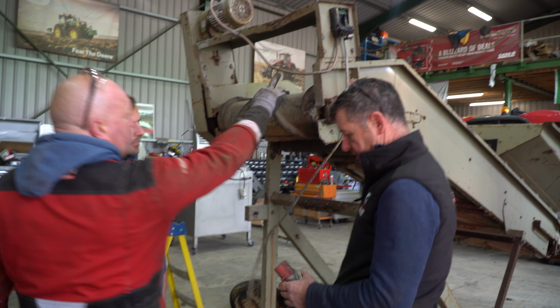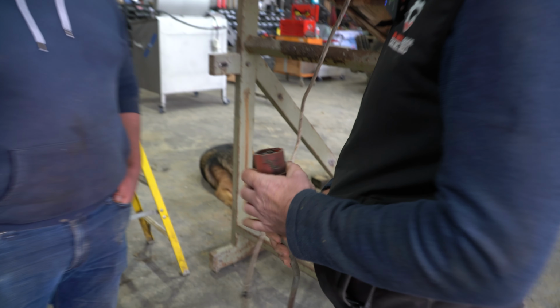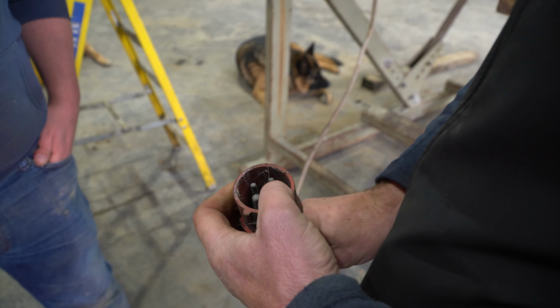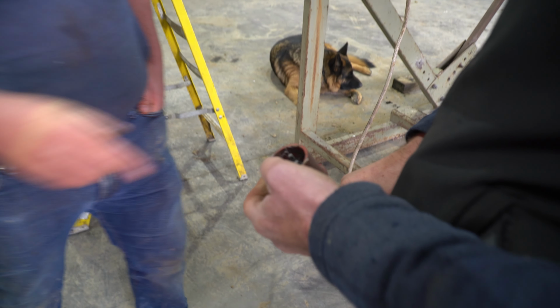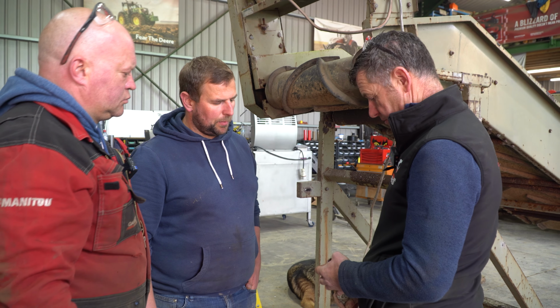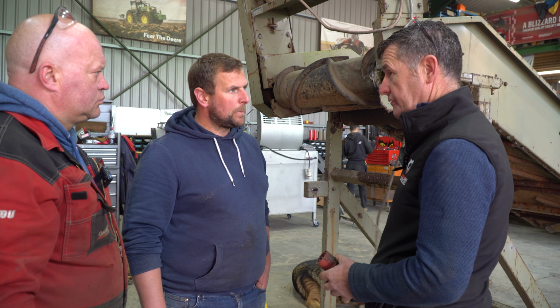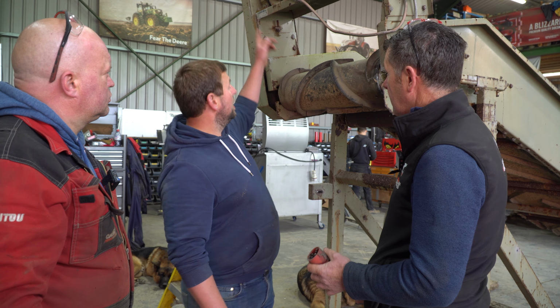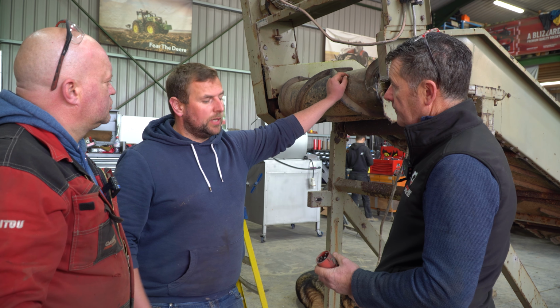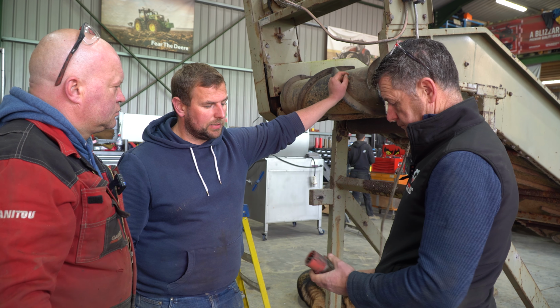David's going to change the plug. So it comes here with a three-phase plug and it's a three-phase motor. And it's probably without a neutral, is it? Yeah. So you've three phases here, three phases there. That's all you have on the four pin. So it does away with your neutral altogether. Yeah. So a lot of anything around here with a five pin. Any motors or anything like that would be all balanced, so they don't need a neutral. So we balance right across the three phases. So that's how that works.